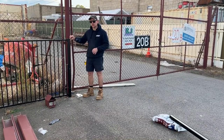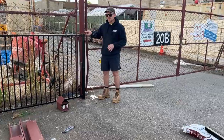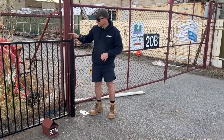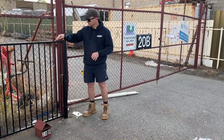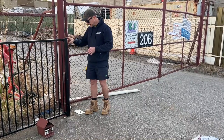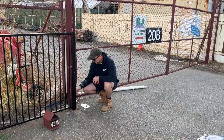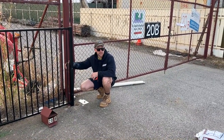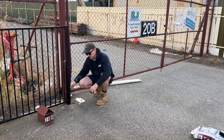5mm is your post cap. When you do the fence and mark it all out, you want to put the bracket just below the fence cap — that way your post isn't protruding too much higher above the fence panel and it gives a nice smooth finished look. I've measured down 1205mm from the top of the fence cap, put a tiny screw into the side of this post, and now we're going to run a string line.